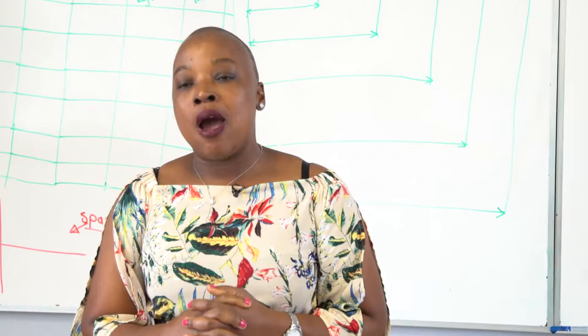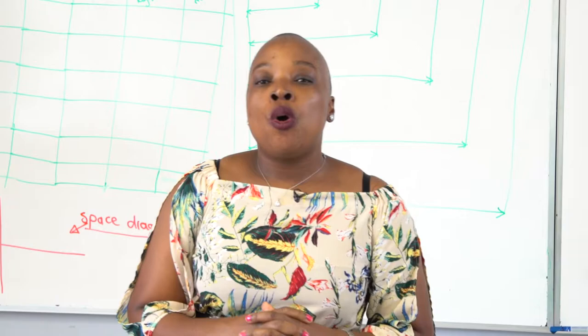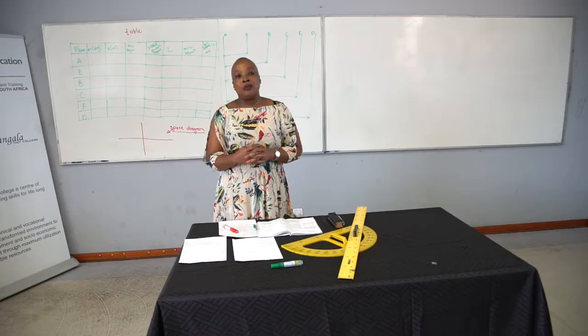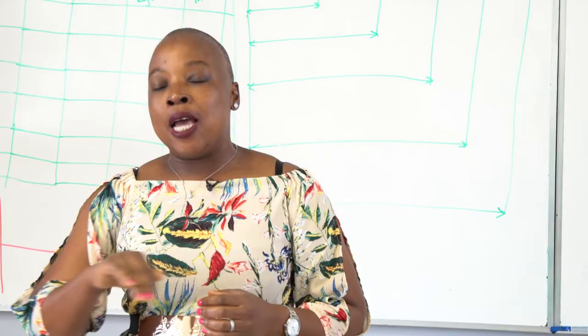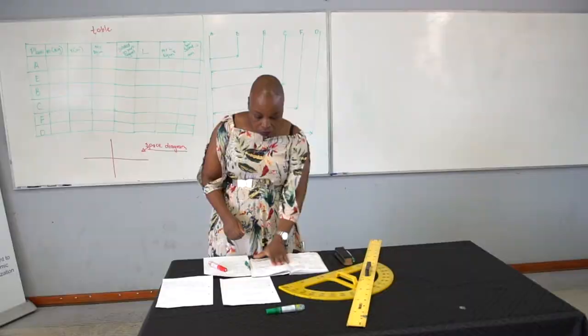So it's very important. Now, how do we prevent or remedy the imbalance of the system? We need to place the balancing masses opposite to the original out of balance mass. This is what it's all about in balancing, to introduce the balancing mass, and so is the position. With that said, I want us to do the activity, exercise 8 number 2.